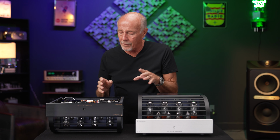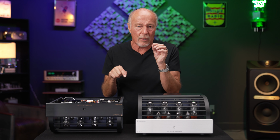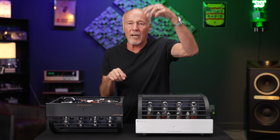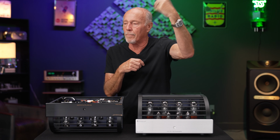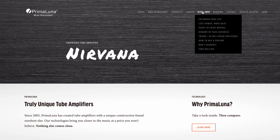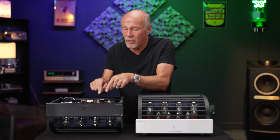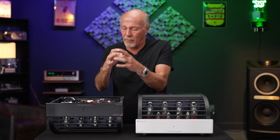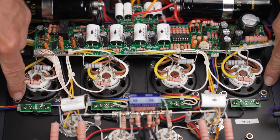Oh, one last thing. I want you to take a close-up shot. When you're done here, I want you to go to the PrimaLuna USA website. There's a page there that is called Important Topics or something like that, Critical Topics. Go there and learn about this. And I want you to look at how the tube sockets are all done. Power tubes should not be mounted to a printed circuit board. Look at the way we do these sockets, these chimneys they have, and four bolts holding them onto the chassis. I mean, it's just textbook.